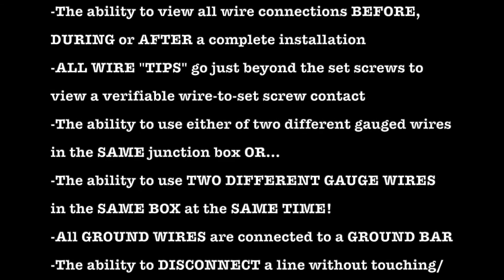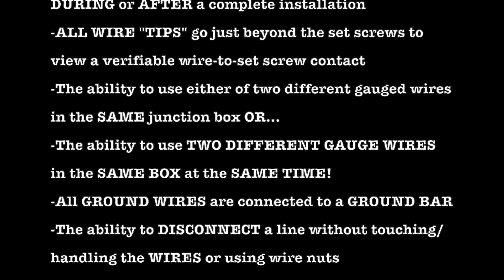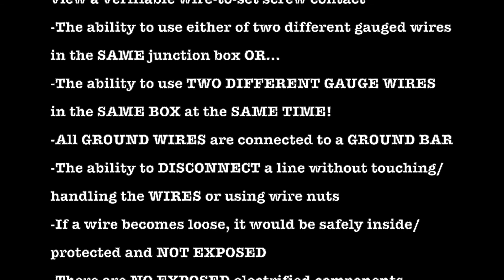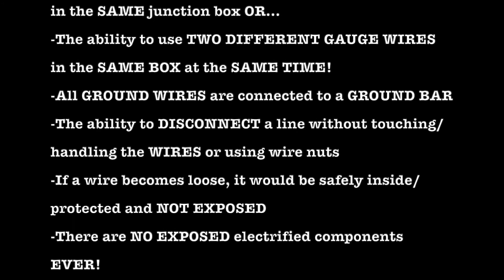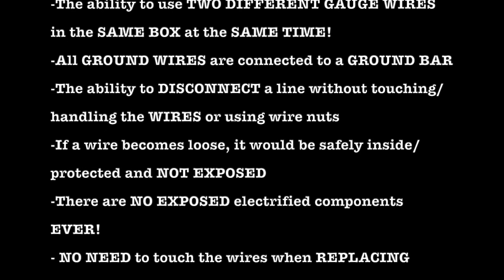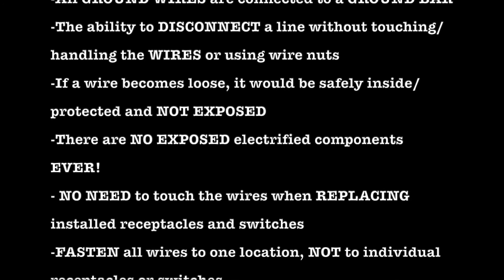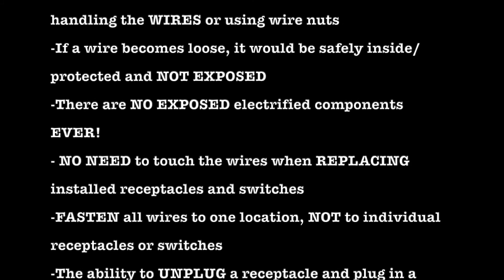Obviously, more space is needed under those circumstances. In our new approach, we simplify this process while adding safety features and removing the stress on knees and hips. In our device, the wires enter the box and travel together as a wiring harness until the harness reaches the hub. Each wire then turns into its own wire entry port. Also keep in mind, a good portion of each wire is inside the hub, where the hub is already in the calculations.